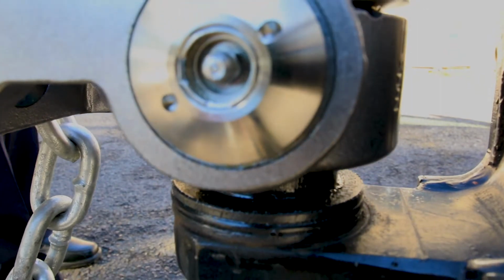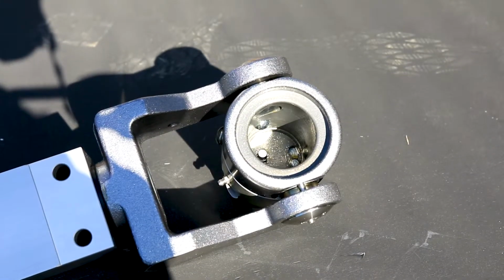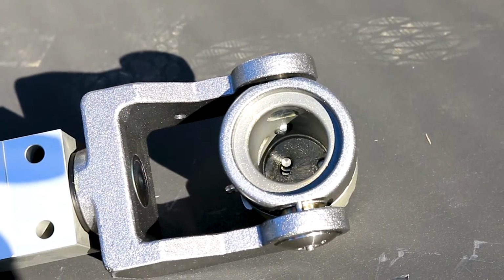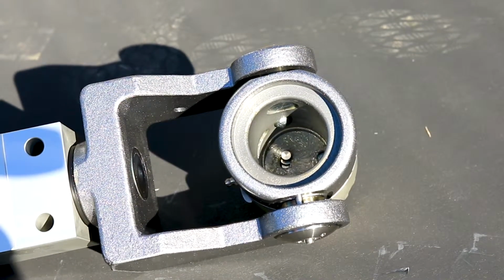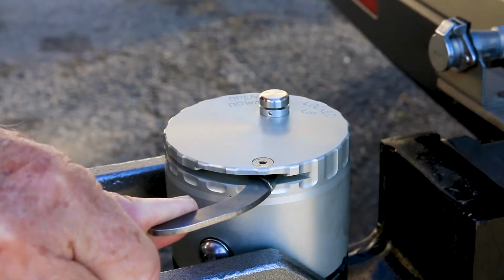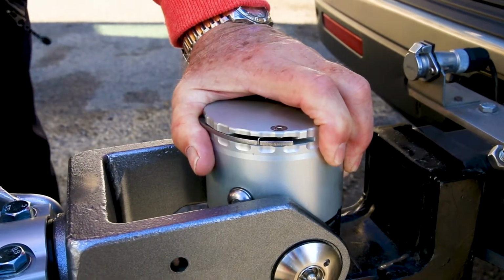In terms of the internal design of the coupling, you have a series of ball bearings, but they're not spring loaded, they just move passively within galleries, and when the recesses within the rotating lid align with the galleries, the coupling can go on and off, and when they don't align it's physically impossible to pull the coupling apart.